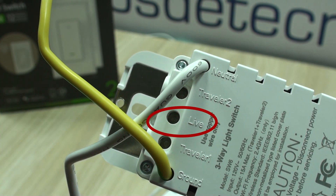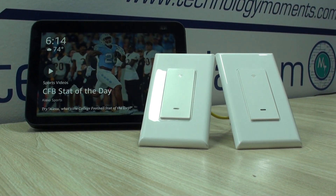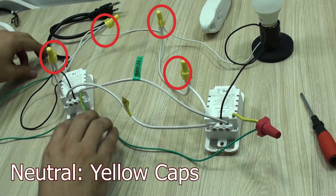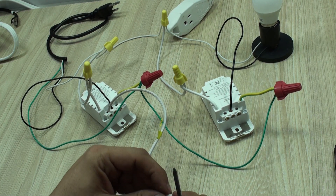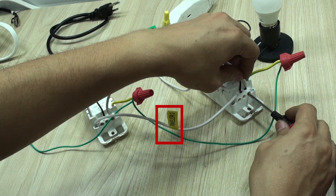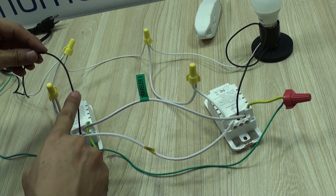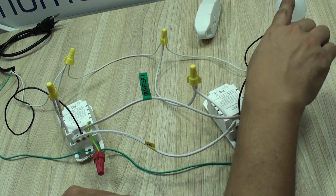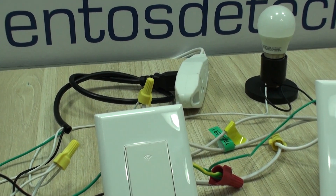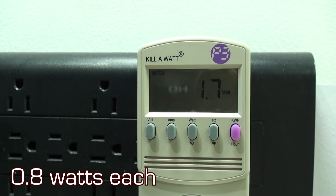We can install just one or two acting as three-way switches. We intercept the neutral and bring it to each device. The hot wire or line is connected here — those connectors correspond to these two in the diagram. We also connect the ground to both smart switches, and finally interconnect the two travelers — traveler 2 and traveler 1. Now we're ready to energize. Electricity will come from here, the switches will choose one of the travelers and reach the load — in this case a small LED bulb — closing the circuit with the neutral. A common question we receive is how much the switch consumes just by being on, which we'll address in another video.